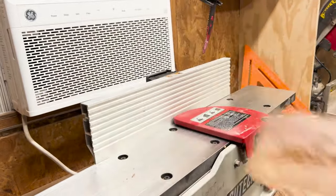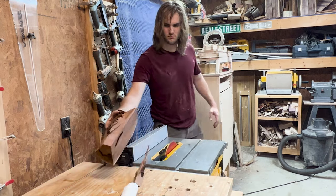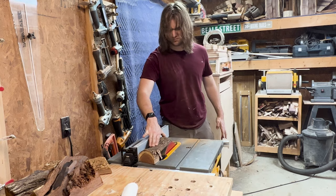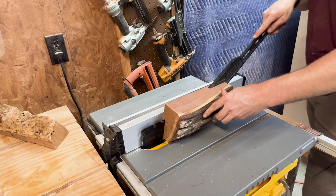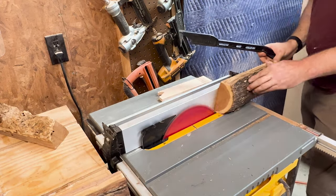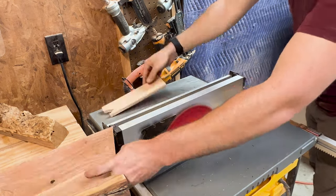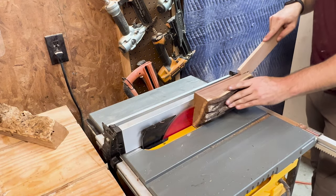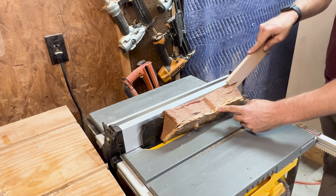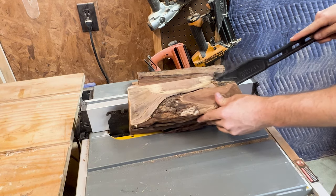I do this so I can cut the final blank on my table saw. I then set up my guide on my table saw. Some of the pieces are a little tall and my blade won't be able to cut it in half in one pass, so to cut everything in half I have to flatten the opposite side of the joint to make sure I have a large enough flat surface to use on both sides. I use the tried and true eyeballing method which works for me about 99% of the time. I run a couple of the pieces through that I know will be too big for one pass, then send everything through my table saw. The majority of the utensils will be about three-eighths of an inch thick while the spoon I'm going to make will be about three-quarters of an inch thick. I try to cut two blanks for each piece so I end up with more than what I actually need. These pieces are quite checked so I know there will be some pieces I have to pitch and use for the smoke box for cooking.